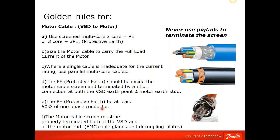but those are some of what are recommended. Now, I have been in the field on startups where shielded wire is not used. It is not required, but it's a recommended best practice to use shielded wire for both your power and your control wires. So these are some of the examples of the wire that's on the market.